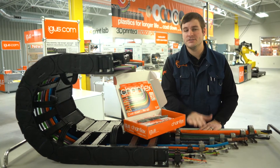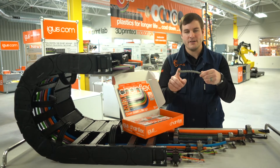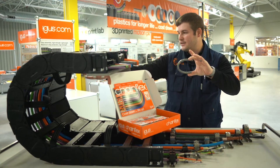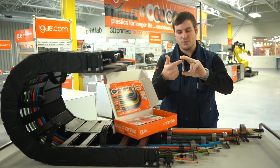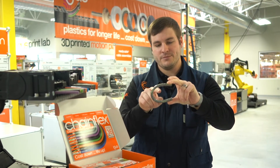Well, actually the answer is all internal to the design underneath the overall jacket. I actually have a cable here with a clear outer jacket that can kind of show this. If we picture it as if it were inside of the radius of a cable carrier, you can actually see that of the 12 conductors we have here, 11 of them are black but that 12th one is a green-yellow ground conductor.